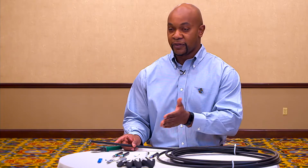The customer base is basically anybody that wants to build any type of LAN network. You can use it in duct space, you can use it aerial, as well as direct buried if you get the armored version. We use this mainly for long hauls because it's an outside plant cable. It is not an indoor-outdoor cable — it's solely for outdoor applications, and if you come into a building, once you go in 50 feet you have to transition over to an indoor cable.